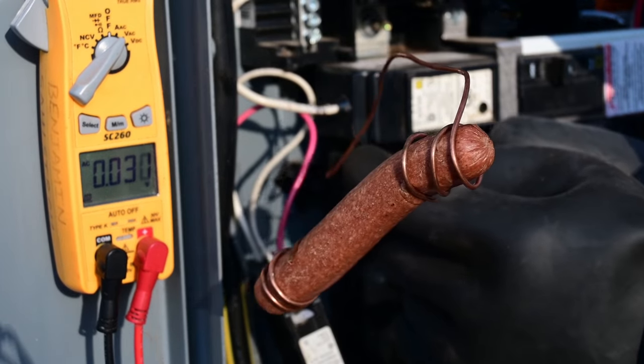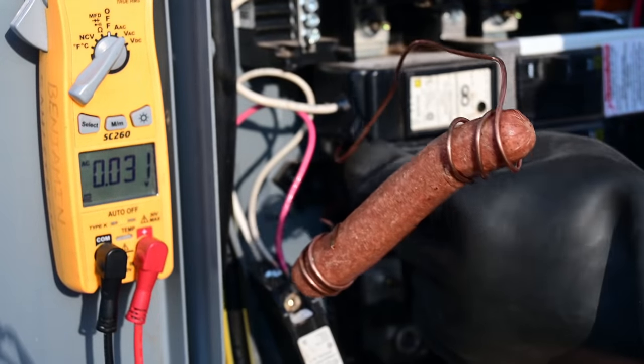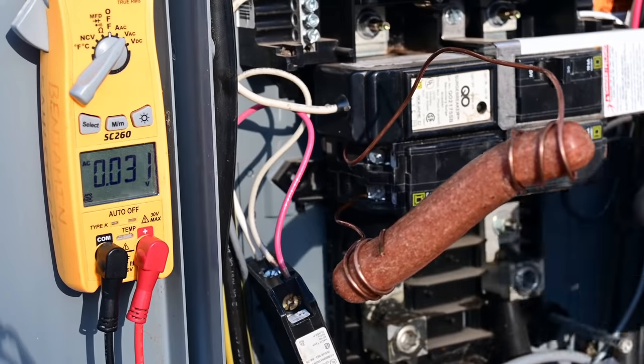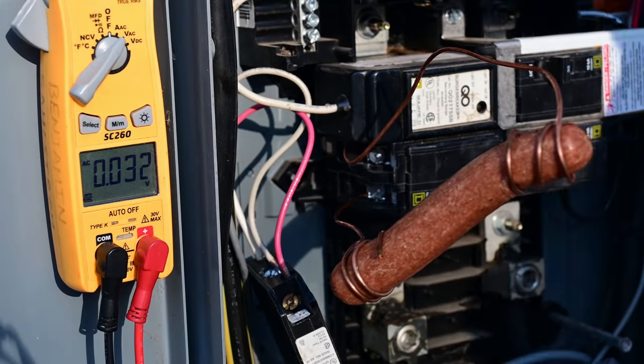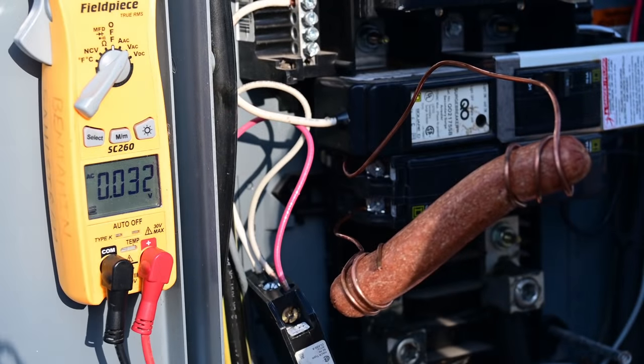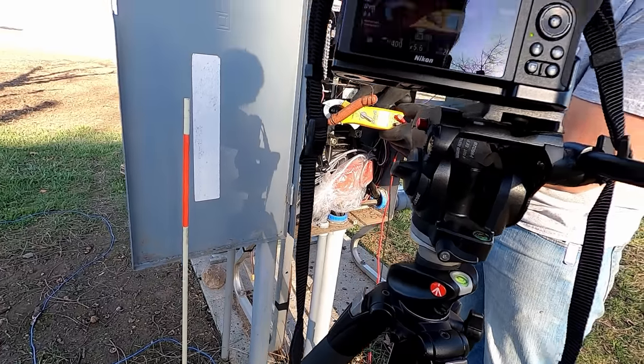What's that wire on the side of the panel? The breaker's off right now, but yeah, it's important to note. Okay, so now the breaker is snapped into the right spot and we should be able to actually test this now. We're going to put our meter back into amps alternating current and get it clipped around here. Okay, here we go. Three, two, one.